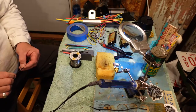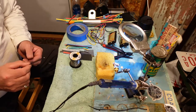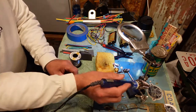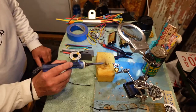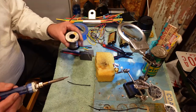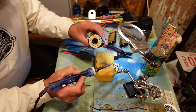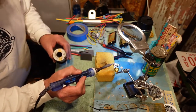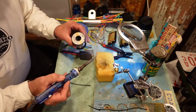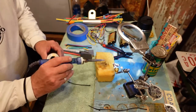Before we get into the details about the wiring harness from the kit — which I'm really happy with — a little bit about soldering. Before you put any wire on, we want to use solder that's for electrical work. They make solder for plumbing sweating copper joints — you don't want that. You want to heat up things, and they call this tinning. If I put a little bit of solder on my soldering iron and then touch whatever I'm going to do, that's good — it makes it ready to go.